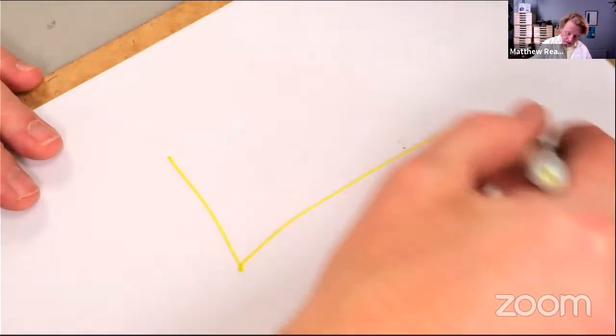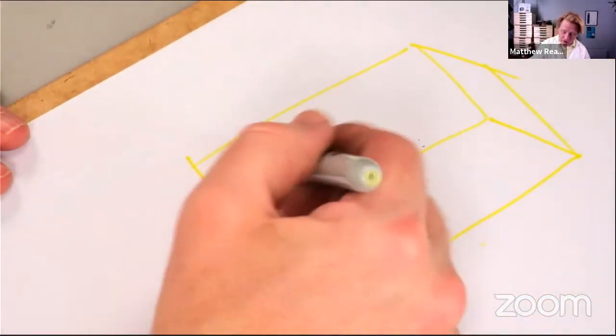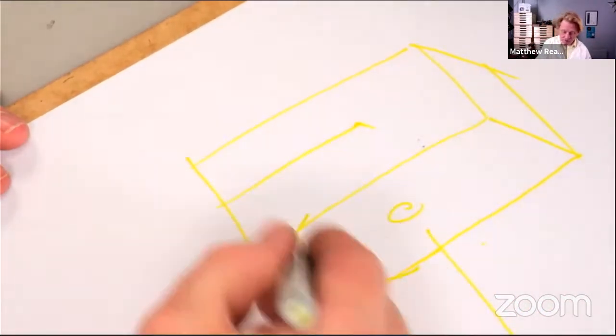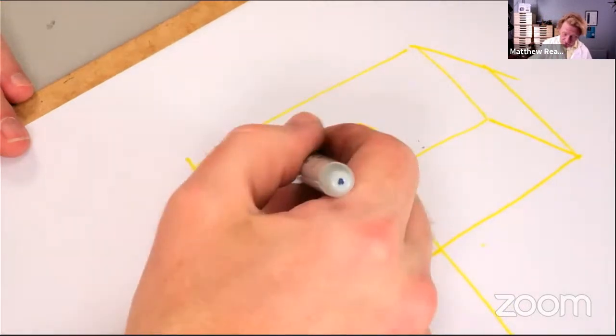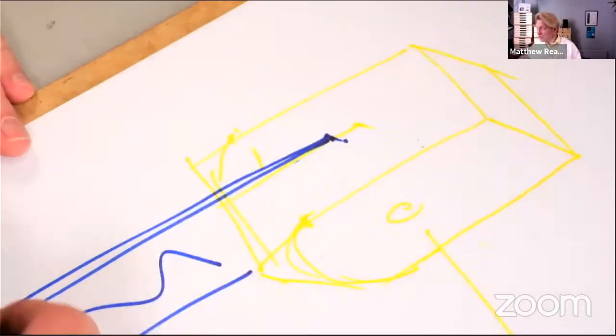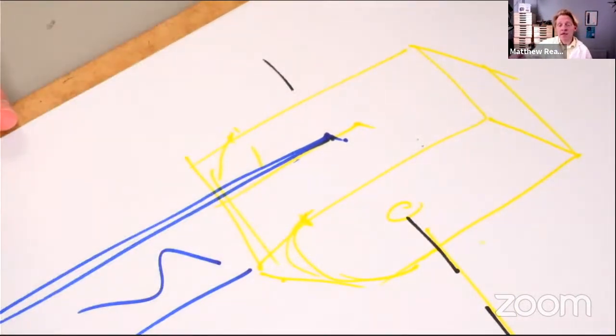So the other ways of doing this, many ways, put a pin through. But one is obviously to get a block of material, whatever it is, like this, and saw a slot like that, drill a hole, put a pin through, radius this at the bottom, like that, and then put our spring in. So that would be down there. And that makes sure, there we go. Which is also quite nice. And maybe if you had a super posh clock, that would be the way you would do it.